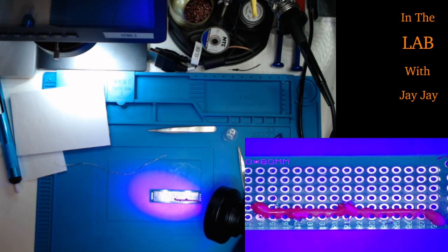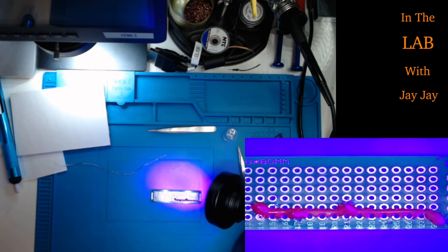I think that might be a good place to end our video. So just to recap, we've used small, medium, and large bodge wires. We've melted them into place using thermal technique to remove the enamel. We just basically burn it off with the solder and the soldering iron. We used plenty of flux, we gave it a clean, we checked our work as we went along, we buzzed it out to make sure that everything was connected. We painted on UV solder mask and we hit it with UV light. And we've got a fairly professional looking bodge wire. So I'm pretty happy with that, and we might leave it there.